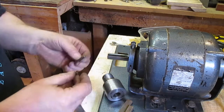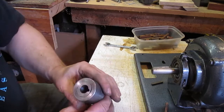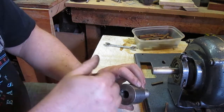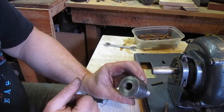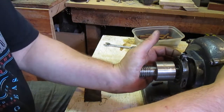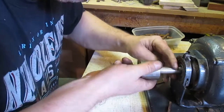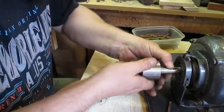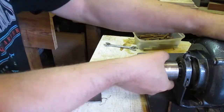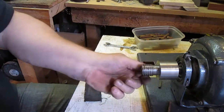It's about the right length, so I'm just going to take two corners off. I notice the hole is not running exactly — it kind of tapers off towards the centre of the main hole very slightly, so I've tapered that a little bit. And that now is a nice tight fit — you're going nowhere. That'll do. Now I need to put a hole in for a grub screw through it. Should be easy enough.